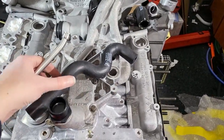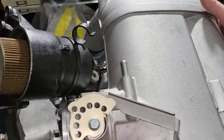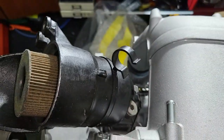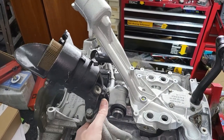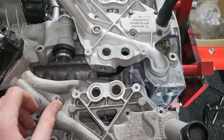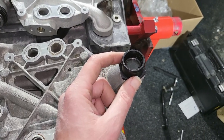This is the 996 manifold, but I'm going to run the 4 litre intake. With the 4 litre intake the plenum hits on the back of the housing, so to fix that I need to change this oil manifold to the 997 part. Compared to the 996, the 997 manifold has a different shape at the back of the filter housing which gives extra clearance. The 997 also uses a single combined oil temperature and pressure sensor, whereas the 996 has separate takeoffs for oil pressure and oil temperature.